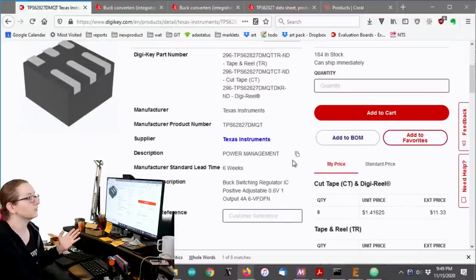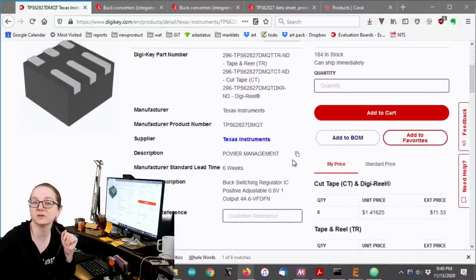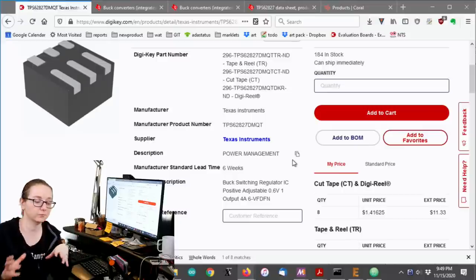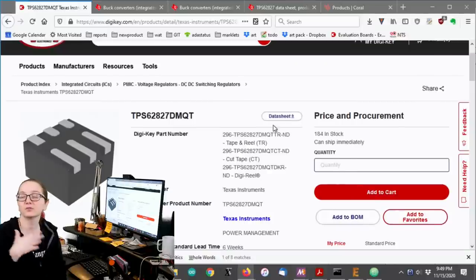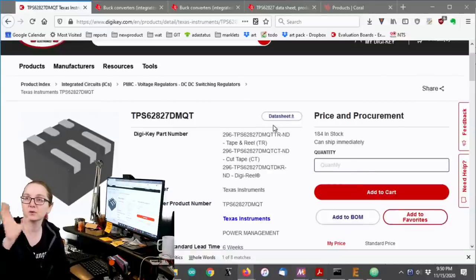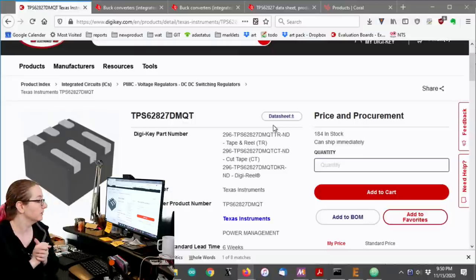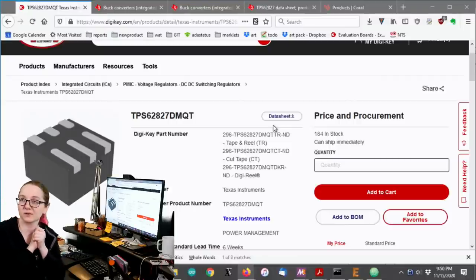There are regulators with a couple of options, fixed and not. This is the full series — I think this one is the 4 amp version. They have a couple in stock. At tape and reel, they're 88 cents, which is a good deal. With the inductors and capacitors, the whole power supply is maybe two bucks. It's active and they have a CAD model so I can get started instantly. I like that it's just small — I don't need special heat sinking. I'll just check the datasheet to make sure I can use it on a two-layer board, plug this next to the Coral module, and try running some vision models. The TPS62827 — that's this week's Great Search with DigiKey.